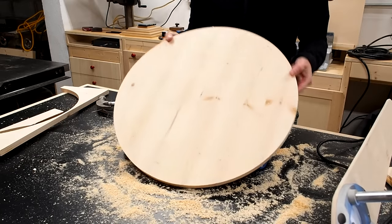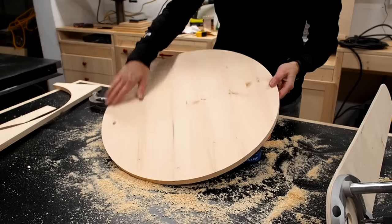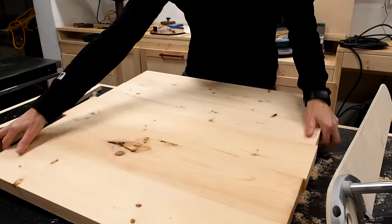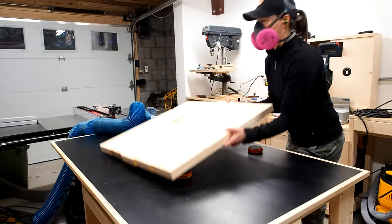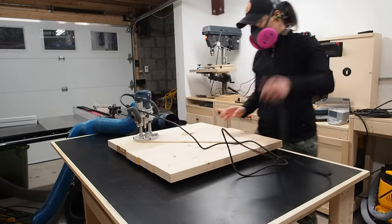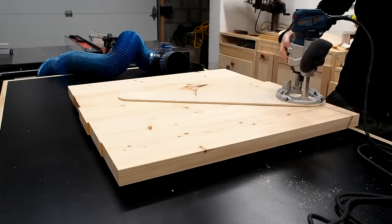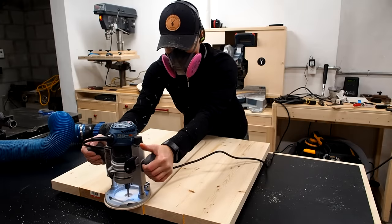This piece was relatively thin and although large, not that large. So what happens when you have a really big piece like a tabletop that's thick and maybe out of hardwood? That's where the second method comes in, combining both a router and a jigsaw. Just as before I'll first start by using a router circle cutting jig. I made another pilot hole in my jig to make a larger circle, found the center of my piece of wood, and secured the jig with a small nail.